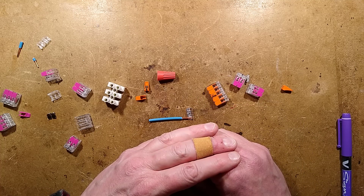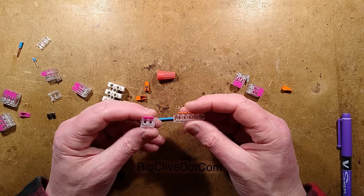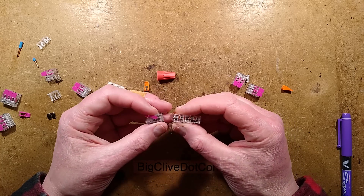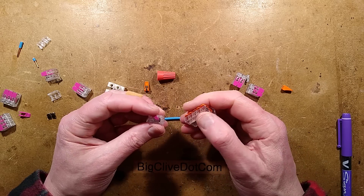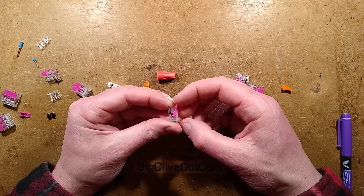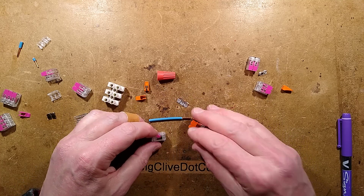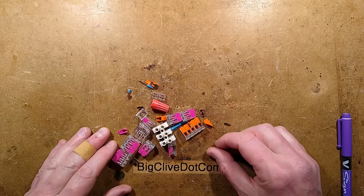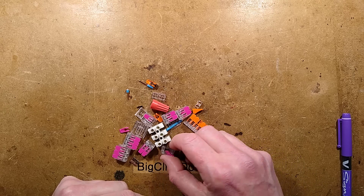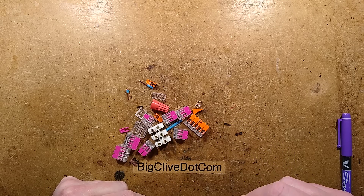So that's what they're like inside. Just like their other connectors with the bigger lift-up levers, the clone is actually an evolution — I think it's a better design in terms of number of components and ease of manufacturing. It's bigger and chunkier — there is a noticeable size difference — but the reward is much greater simplicity. The way the lever rocks, it just finds the centre point of the contact and clicks over the midpoint and holds up — it's a very clever design. For professional applications, only use branded WAGO terminals; for personal projects, these clones are much better than expected and actually reasonably good.